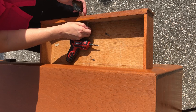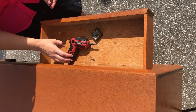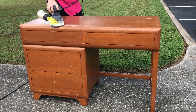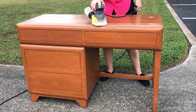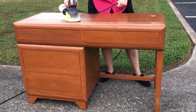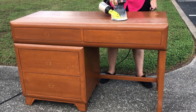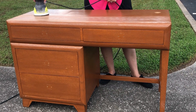After my piece is clean and I take the knobs all off, I'm ready to give it a light sand with my orbital sander. I have a 220 grit sandpaper — it's a very light sandpaper. I'm not going through the finish; I'm just scuffing it up to give my paint something to grab onto. I did go a little more over that spot on top. It needed a little extra smoothing out to get it smooth to the touch.